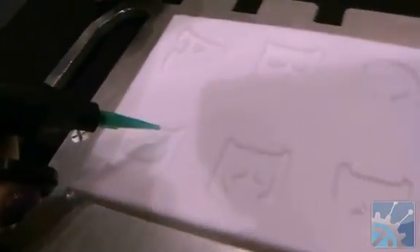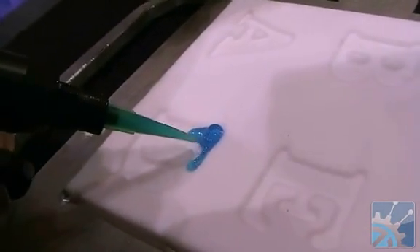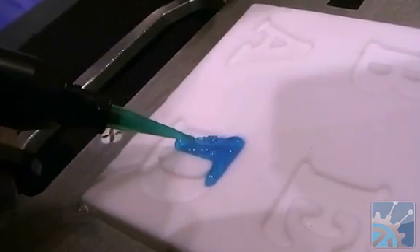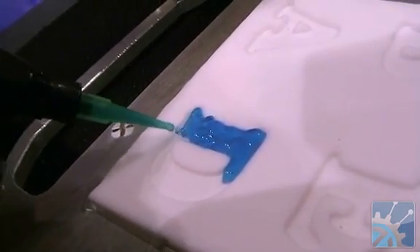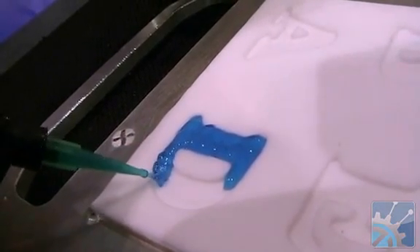What we're going to do here is dispense the material from a cartridge dispensing system. I'm going to fill the whole template. As you can see, when it's going down, it's a brilliant blue so that the customer in their application can see the placement of the adhesive and how much material is being placed down. Now I'm placing more adhesive than normally would be used in an application for this demo.